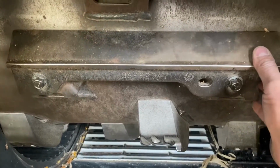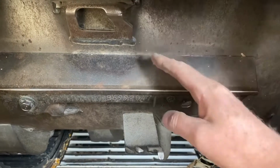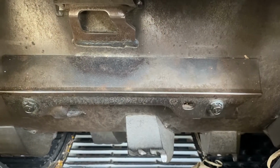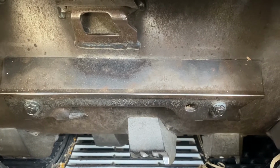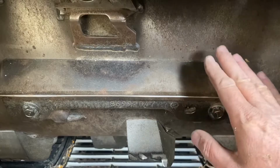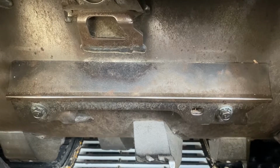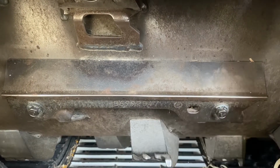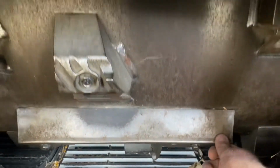So that straight bar, good tool for corn, kind of acts like a dam. That crop's flowing around, it hits the straight bar, helps carry it around for extra passes and extra separations. So really a corn tool. Adding the straight bars, really don't typically need it when we go to soybeans. So if we're dealing with green tough beans, a lot of times I like to take these out and put regular rasp bars back in place of them.